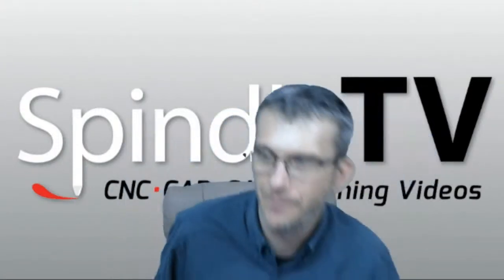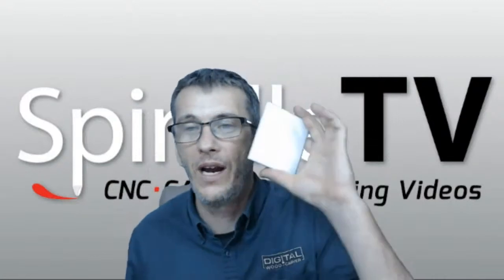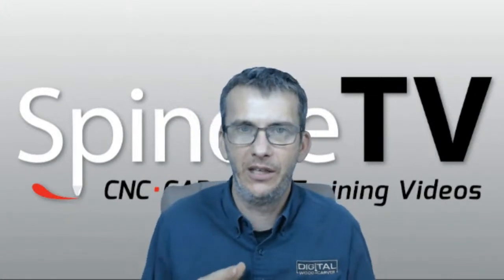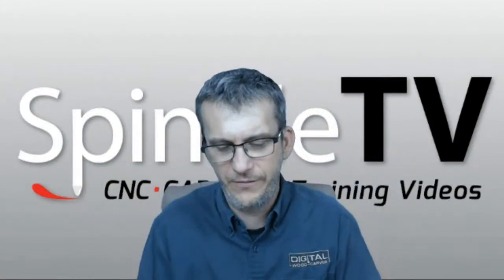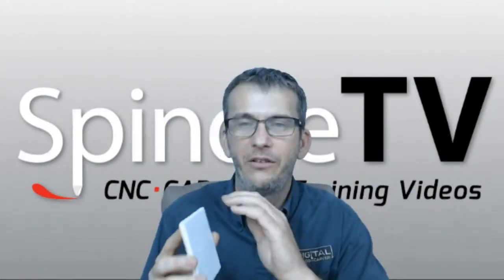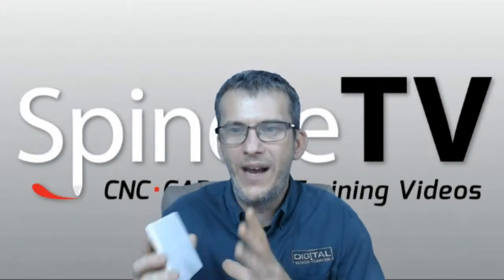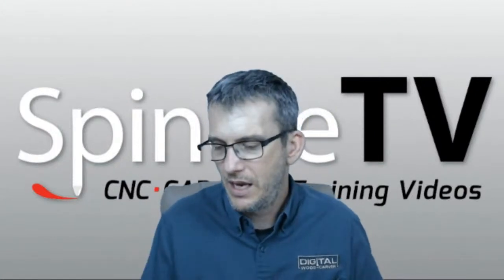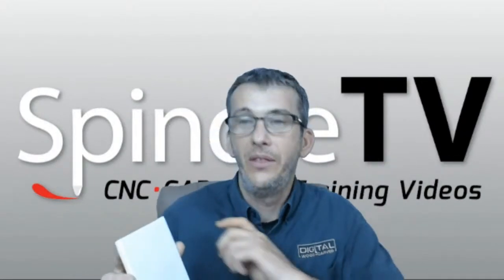But let's talk about the white tiles first. So I sprayed two coats, nice even layer coats and everything. But before I painted the tiles, I wiped them down really well with lacquer thinner. Because the tiles have fingerprint grease and all kinds of stuff on them from manufacturing, but they also have a residue on them. So the first thing I did is I took a cloth and some lacquer thinner. You can use acetone too, but lacquer thinner. And I really wiped them down and polished that white tile very cleanly so that the paint sticks to it very well. So I wiped it down with lacquer thinner, let it sit for a minute, and then I took a dry rag and dried it off and buffed it off. Then I sprayed the white paint.